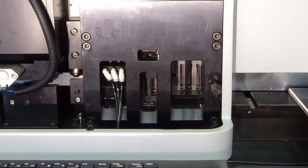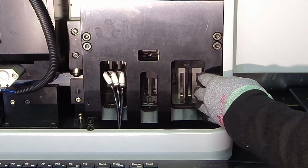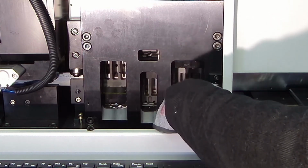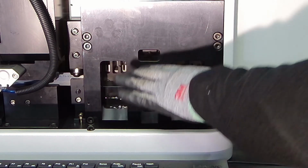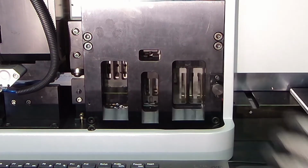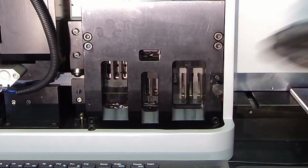and as you can see here, this is the cutting part of the tooling that goes up and down automatically depending on the height of the rule to be processed. And then this is the perforation part of the tool that also goes up and down depending on the height of the crease part that you want to process. So this is fully automatic. Everything can be configured in the settings of the EasyWin software. So I might point this out, out of this opportunity.